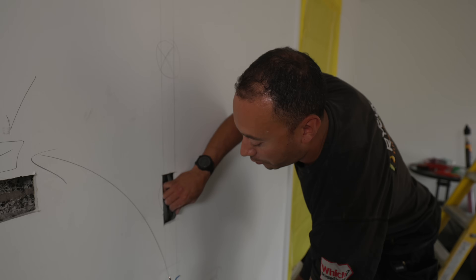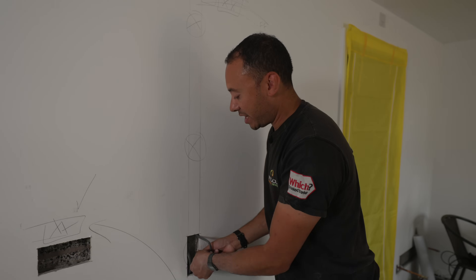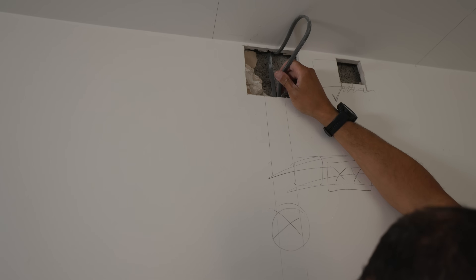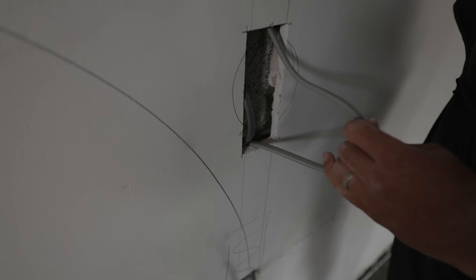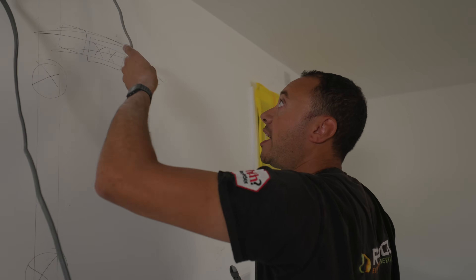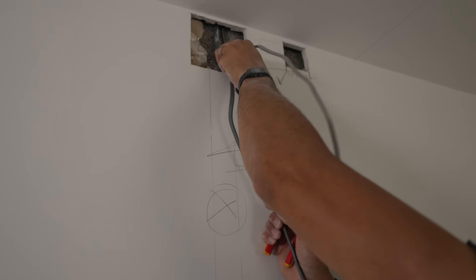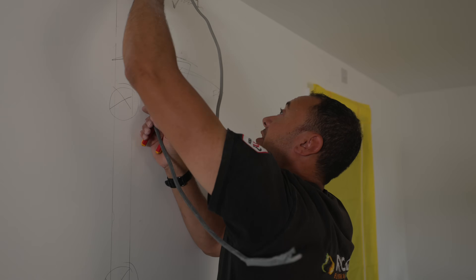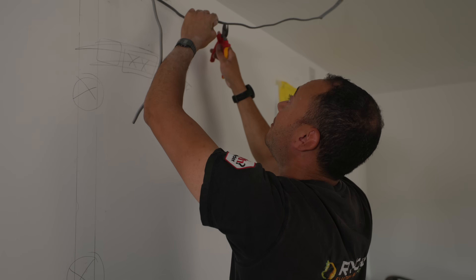This cable we're going to pull all the way up through the wall — pulling up the old cable with the new one joined onto it. This old cable isn't just a pulley; it's important we keep it because we need it to complete the circuit. It helps having long arms for this bit so I can pull it straight up the wall. That's our new cable ready to go, and for good measure I'm going to put some slack up in the ceiling as well, so if there are any alterations in future there's a nice bit of slack. There's one.